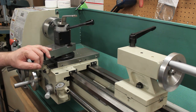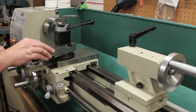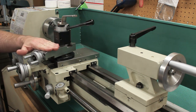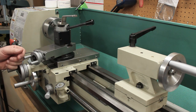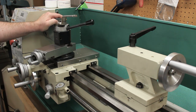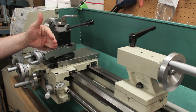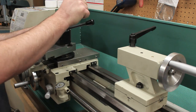This is my lathe — a benchtop model, the Grizzly G0602. It's about a 400-pound lathe, so it's a pretty decent machine, but it's not huge and it has a limited amount of space for a spindle. The biggest constraint for putting a tool post grinder on this is that I really want the spindle to clear the compound, because I plan on using it to grind tapers — especially tapers like tool holding arbors, Morse tapers, and ER collet tapers. To do that I'll need to use the top slide set to the taper angle, which means the spindle has to clear it, and there's not a lot of space to work with.